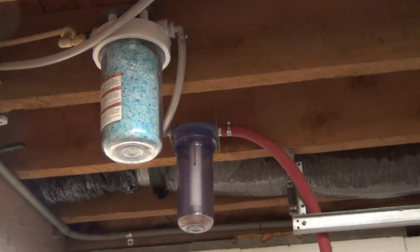For those of you who are do-it-yourselfers doing some sandblasting in your garage, this is a good setup for light sandblasting. It will get your line moisture down to a manageable point — you won't get water spitting out of the sandblaster, it won't be clogging up, and your air tools won't rust on the inside. If you find it interesting, give it a thumbs up — and I'll see you in the next video.